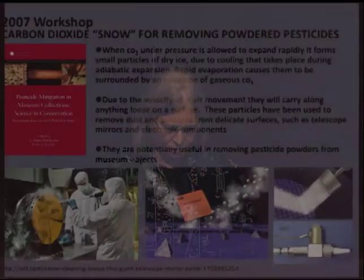Astronomers had been using the technique for some time to overcome scratching and fracturing that would be a problem for their mirrors using other techniques, cloths and so on. So we considered several types of gas and the use of ice pellets as cleaning possibilities. We liked the idea of the CO2 snow particles, because they could transfer and displace particles of surface soiling.